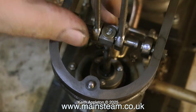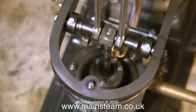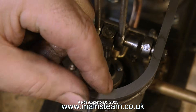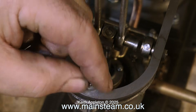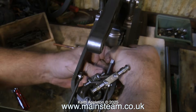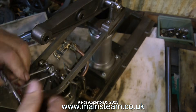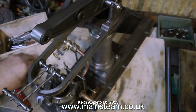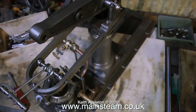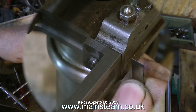What I need to do is adjust the position of this horseshoe shaped part so that the piston rod is exactly in the center of the two sides. As you can see, the two shafts that stick out from the piston rod are much closer to the left than to the right. So what I think has happened is that the builder got very confused with this and thought: 'If I move the beam to the right, the motion will pull this over to the right hand side and everything will be fine.' But of course it's not. One thing's for certain — I need to find the root cause of this problem before I can put it right.